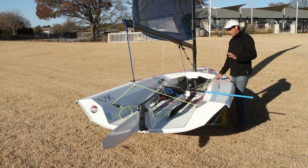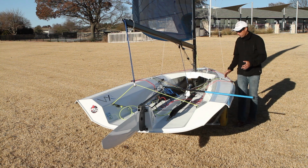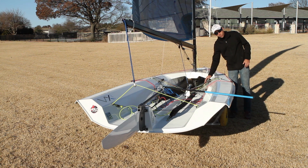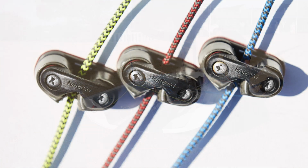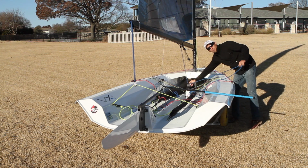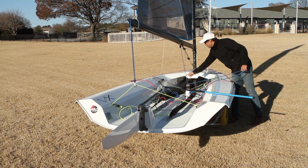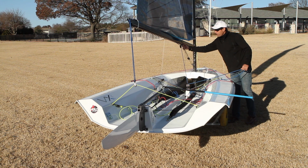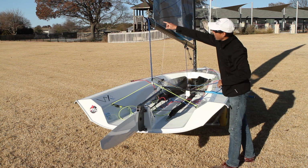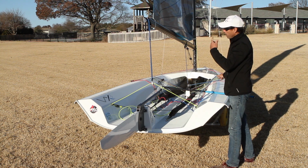The VX EVO has a very simple approach for everything we do. From the beginning, we have only 3 mainsail controls besides the main sheet, which are Cunningham, Vang, and outhaul. And then we have the actual main sheet, which goes from the barney post on a swivel base into a ratchet block, a 40mm ratchet, then goes inside the boom, sticks out in a boom end sheath, goes around an offset block, a 29mm block, and then goes back up and ends on the boom.